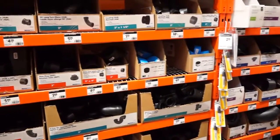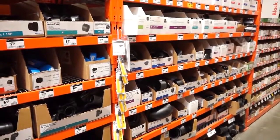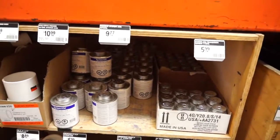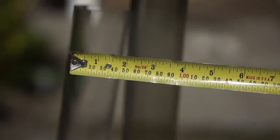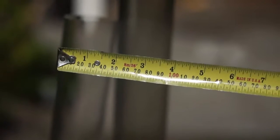The white stuff is PVC; this is ABS. We're going to need that to connect to the pump. There's an adapter you may need in case you've got to go from one size to another. The glues — make sure you've got the right glue: ABS glue, PVC glue. There's the pipe that's going to go into the center of the fountain head.